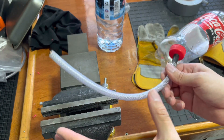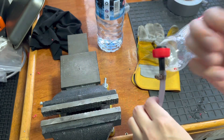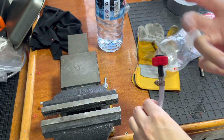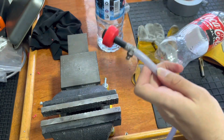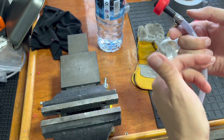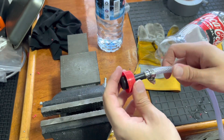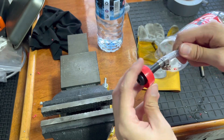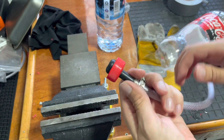If you want to test whether the bottles are sealed properly and you don't have any leaks, put a little bit of soapy water inside the bottles, then pressurize them and move them around. If you see any bubbles appearing or soapy water spurting out of any gaps, that's where you need to go back and check that you've made a nice round hole or that you haven't missed anything.